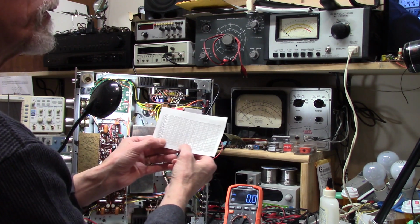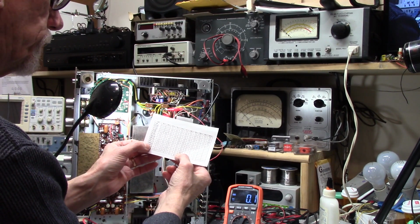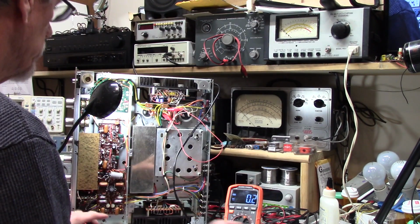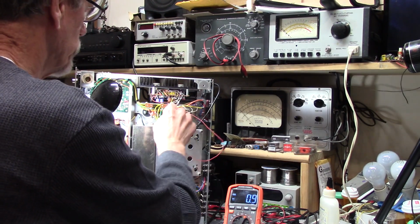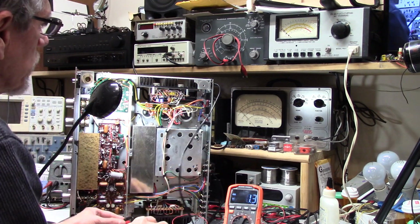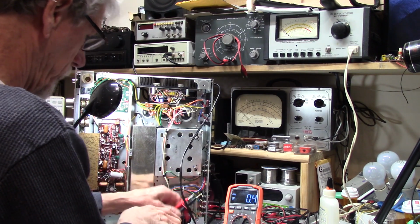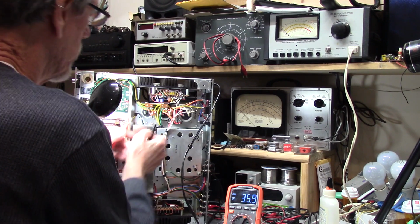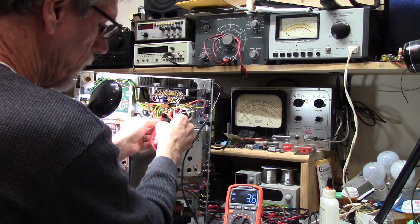All right. So looking at my chart, 0.1 is what that should be. This is reading 0.03. I'd say that was an overachiever, which is fine. And let's see. Okay, I can't. Ew. By hooking there, I didn't really hook across the capacitor because there's a resistor hiding there and I didn't see it. But it should still. Millivolts, we're good.